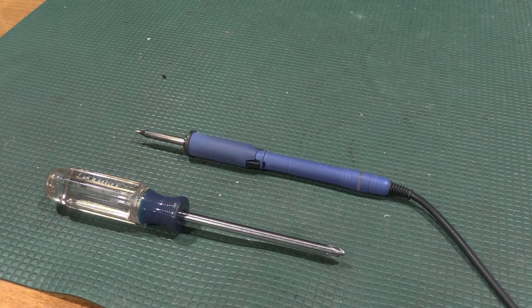My reels sit on a rack in a temperature controlled room, but I'm not concerned about the humidity doing hand soldering and essentially small batch work. I should also note the rack I have is designed for IC reels and it is an anti-static rack that is actually strapped to ground to protect the components from static buildup. Check out the back video catalog for some of that information.